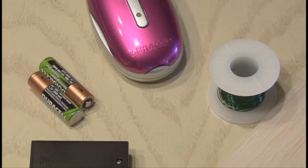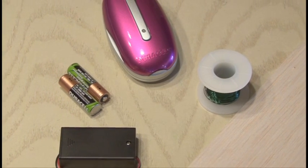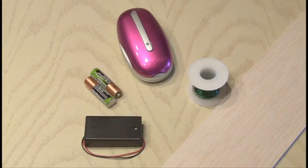To make the Personal Portable Heater, you'll need two AA batteries, preferably rechargeable with a recharger, a twin AA battery holder, some 28 to 30 gauge winding wire, and some balsa wood.